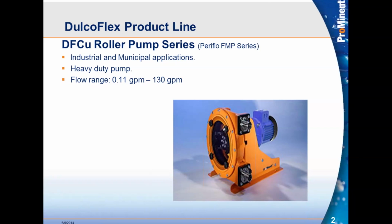Flow range starts at 0.11 gallons per minute with the smallest pump, the DFC 30, that's the minimum flow, to 130 gallons per minute, which is the DFC 70. Obviously, we do not recommend running a pump at full capacity. You've got to look at it as your car. You don't run your car in the red RPM 100% of the time because your car won't last long. Same thing with these pumps.